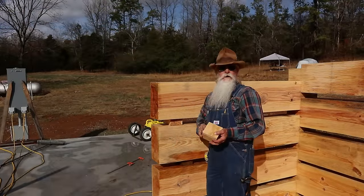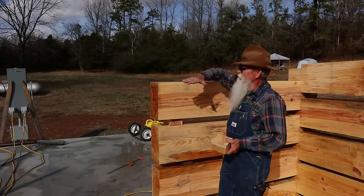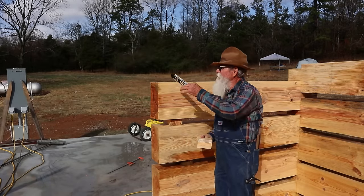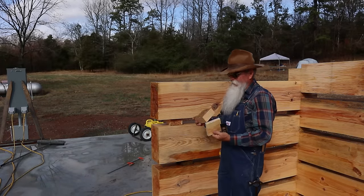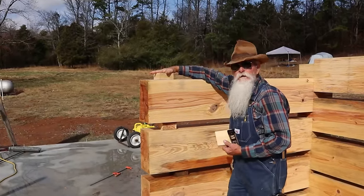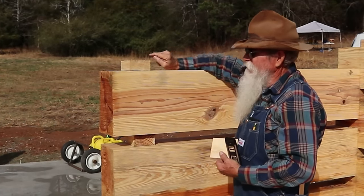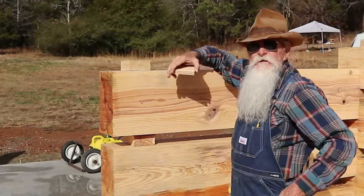One of the things that's been quite easier is our blocking at an opening. Since we do have a flat surface here, we do true them up, and I'll check it with a torpedo level and make sure that it is sitting level here on the top where I put my blocking. We're starting out with just a square block. We set this up here when we set our log, and then with the little center marks, I don't know that you can see that, that's pretty light. We can tell when we put our strings across what we need to raise the log itself.